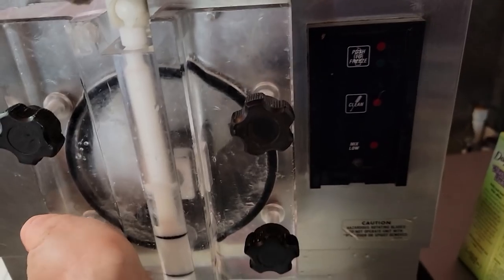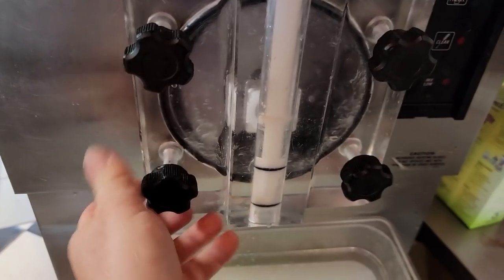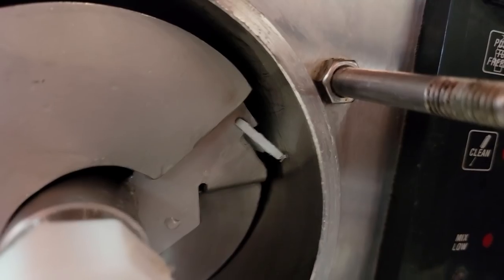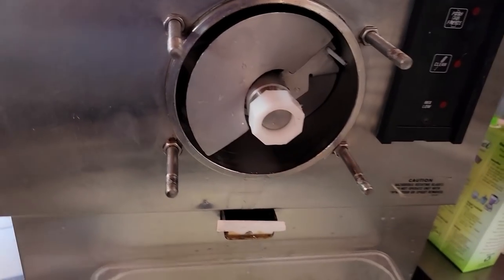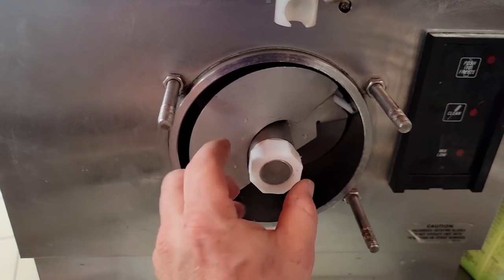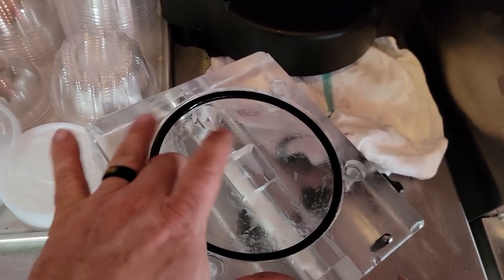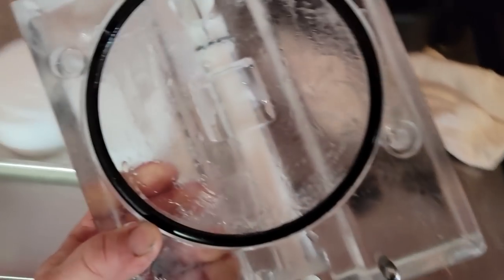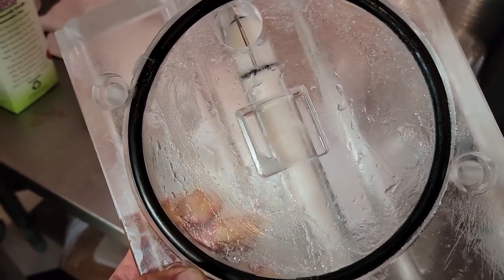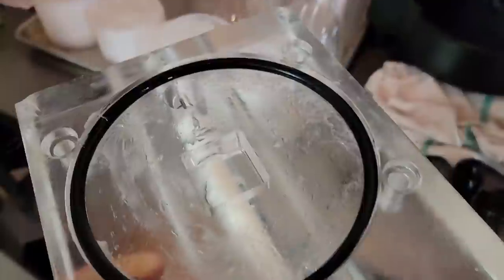Let's take a look at those wiper blades and make sure they're still in place. I don't want to dump all that mix in here and find out they're not in position. You can see the wiper blade right there - the little flat thing - and you can see the other one right there, still in position. When the person was showing me how they put it together, there was talk that this bushing might have gone on the back. That very likely is what happened, but nobody wants to admit it. There's lubricant on the front which should not be on there.